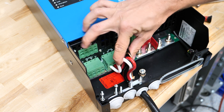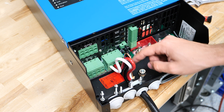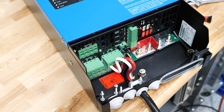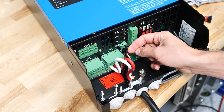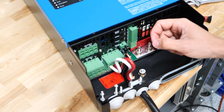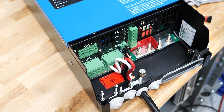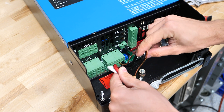I've seen customers who don't put any extra wire inside — that's bad practice. What they do is cut them all to the perfect length and shove them straight into the hole, leaving only about 3 inches of wire inside the inverter. I definitely don't recommend that, because if you come back in a couple of years to check these connections and something's not right, you need to redo it. With this style, we can always pull the wires out, bend them straight again, strip some new insulation off the end, and have a fresh connection ready to last for years. If you went straight in, it would probably require pulling the wire out completely and replacing some of it — if it's too short, you may have to replace the whole section. Always give yourself some extra slack to work with.